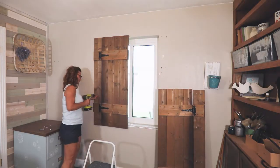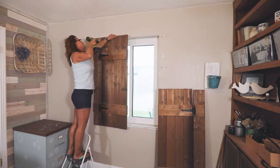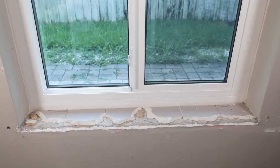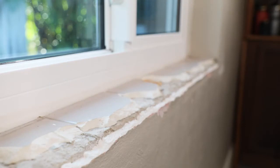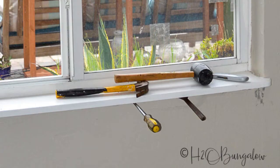To get started, you'll remove the curtains, shutters, and any window hardware first. Our home originally had tile windowsills. I tried to chip them off, but it was easier just to add the sill right over top. If you are removing windowsills, a box cutter will break the caulk and you can pry them off with a mallet, a chisel, or a heavy-duty flathead screwdriver.